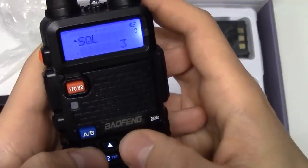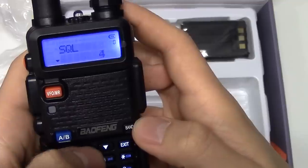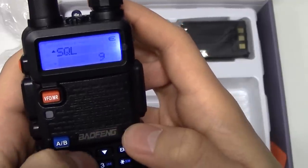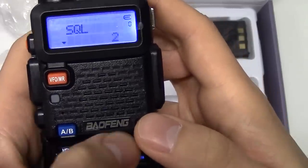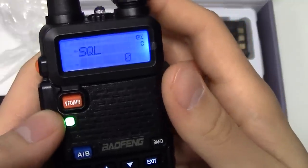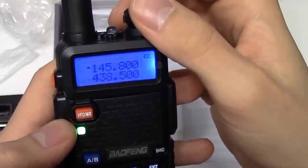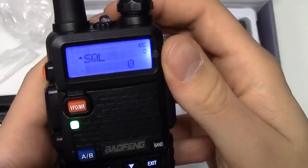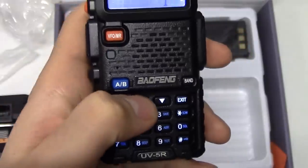After typing in the frequency, you may need to change the squelch as well. Change it to zero in case you don't have a good transmission — use the arrow keys to set it to zero and press enter. Then you can listen in on the radio. Make sure to press exit. With squelch at zero, it will listen all the time, so you'll hear a lot of noise if nobody is transmitting. If you don't want that noise, you can change it back to one.